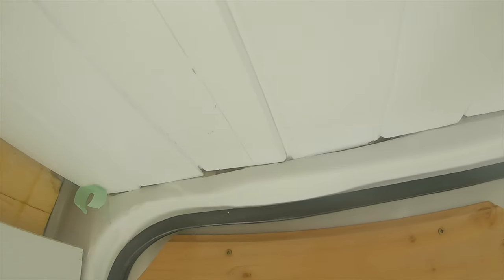I measured the height from that to the floor. I marked my horizontal line there, came out 300 mils, and I used my set square so you get a vertical line up to there. And I measured the distance from here back to there to get my distance along here to run a line all the way along here. Hopefully that will end up being nice and square. So that's why I've got to fix the outside of the roof board.